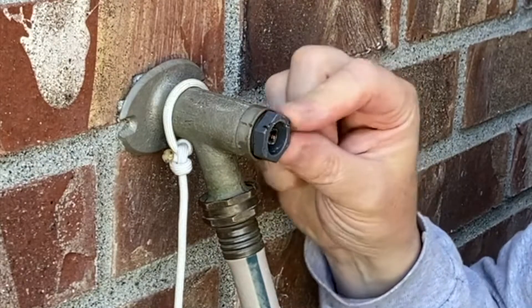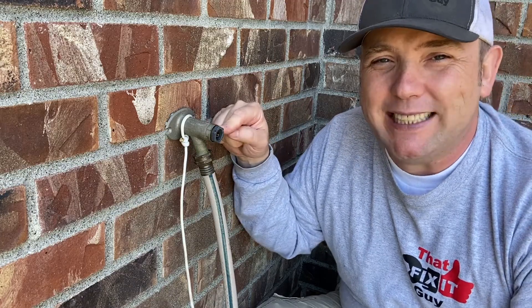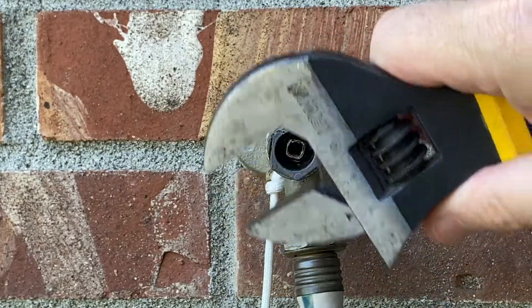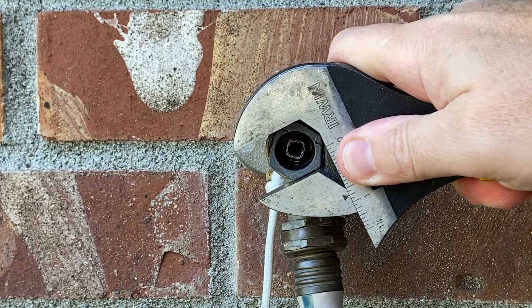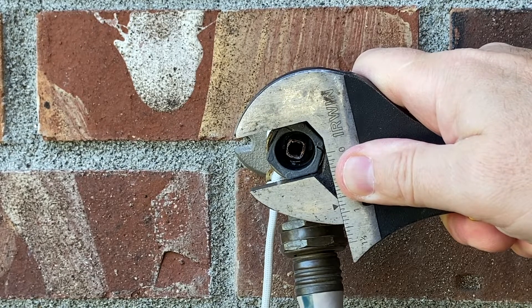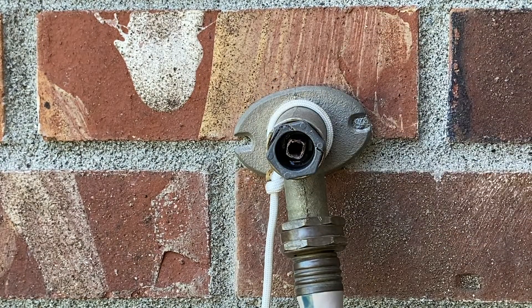You could maybe use channel locks, but honestly this is plastic. If you look at this, you can see this is not the most quality hose bib. We are going to replace this, but I want to wait until fall because we have to cut into my daughter's bedroom wall. With this adjustable jaw, we'll slide it all the way to the back, get a nice tight firm fit, and just slowly turn it just a little bit. You do not have to turn this a lot — it's a packing nut. If it loosens back up, you can just turn it a little bit more. You want to just go a little bit and try it.